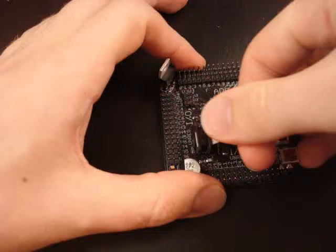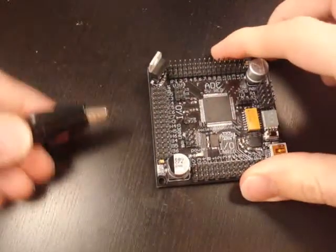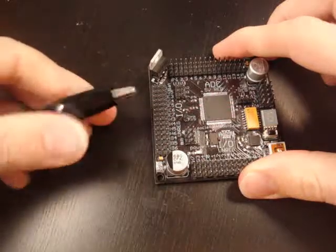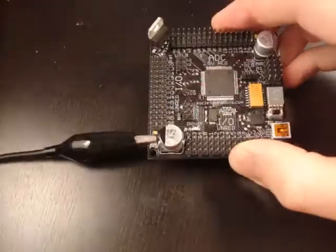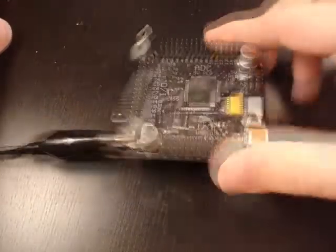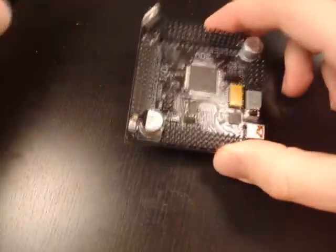This is the hardware programmer right here. You've probably never seen this with another microcontroller, but the Axon 2 has a feature where you can hook up an alligator clip. There's a pad at the bottom left where it securely connects to ground, so you can shake it and it won't come loose. You can connect it to oscilloscopes, multimeters, etc.